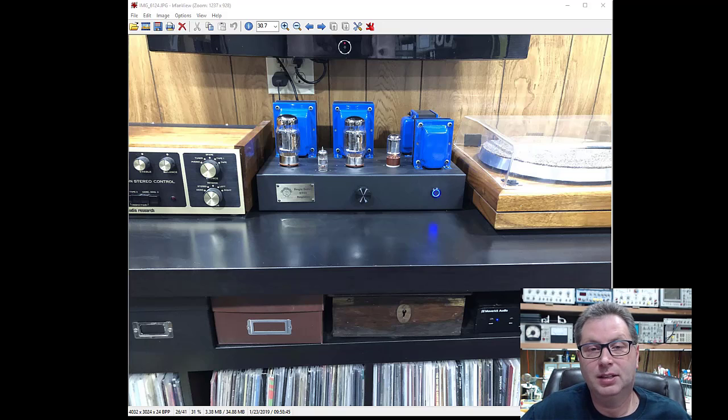Second thing is that you're running this light via AC, and so this LED is only conducting on the positive cycles of the waveform of the sine wave. So what that leads to is something they call 60 hertz flicker. So this thing is turning on and off as the sine wave conducts through it, and it's doing that at a rate of 60 hertz. Now, some people will say they can see 60 hertz flicker.